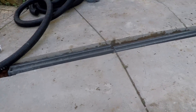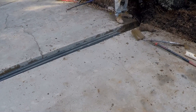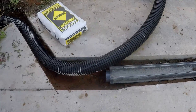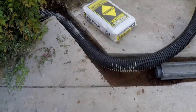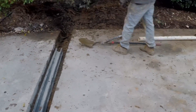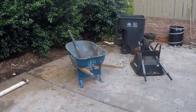So we're getting ready to install our channel drain, and you'll notice that we have it kind of centered in the driveway. You could run it all the way across, but for aesthetics you can also leave it in the center and slope everything towards your channel drain. Notice over here where we've got the 45 coming into it — that's going to be solid pipe that comes from the downspouts. That's actually going to run right through our channel drain and it runs all the way out. We'll turn the corner down here and discharge behind that holly tree — it drops off five, six feet right away right back there. So this should work really good.